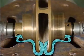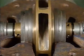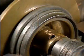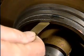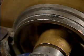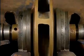Fluid leaking back into the suction eye would reduce the efficiency of the pump because a certain amount of fluid would have to be pumped twice. Wearing rings fit snugly between the impeller and the casing, sealing off the space between them and minimizing leakage back to the suction eye. The wearing ring in this example is held by the casing and is stationary, with the impeller rotating inside of the ring. This ring is called a casing wearing ring. The clearance between the impeller and the wearing ring is quite tight, but the impeller should not be in contact with the wearing ring as it rotates. Wearing rings are designed to wear, and they are less expensive to replace than the impeller.